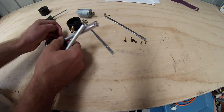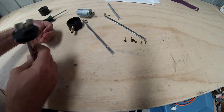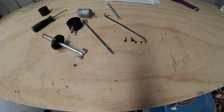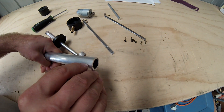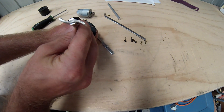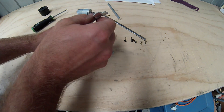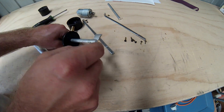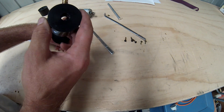So what I started out with for the shaft was just a piece of aluminum rod. For the impeller itself, I used a piece of 25 mm pipe. I just cut a piece — about that much — off the pipe, then split it and folded one side back around on itself, so it has an S shape. Then I just cut down the end of the shaft, bashed that in there, and cut a little wedge out of the top so that the water has somewhere to enter into the drum — into the pumping chamber, I guess you call it.